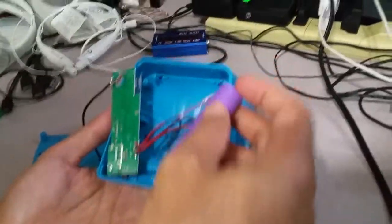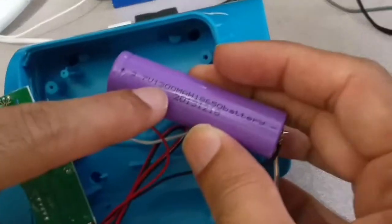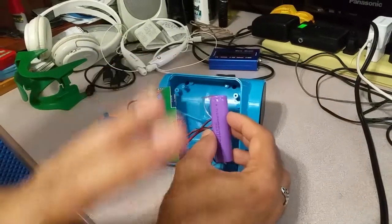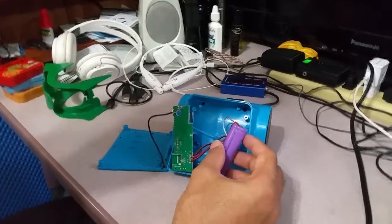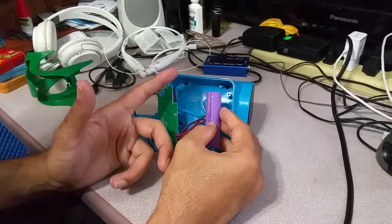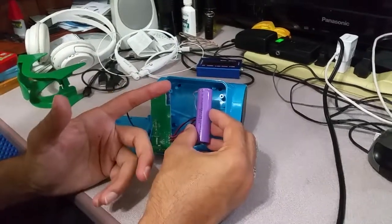When I looked at the battery, it says — as you can see — 1300 milliamp. I took the battery out, put it in my charger, and checked the actual capacity. It was only about 600 to 800 milliamp — not even close to 1300. That's a typical low-quality battery which doesn't last much.